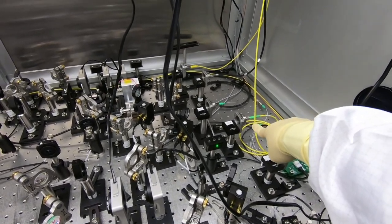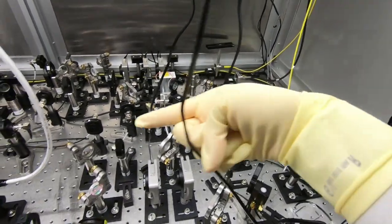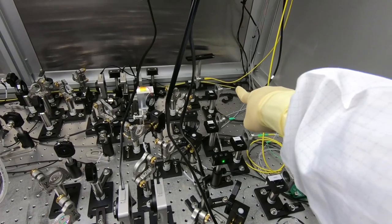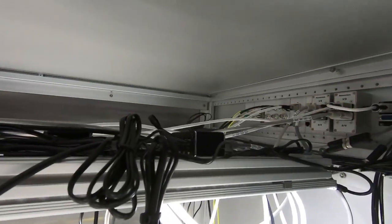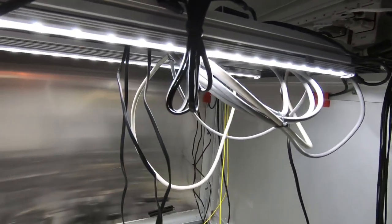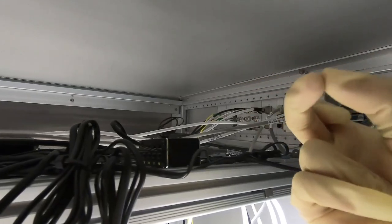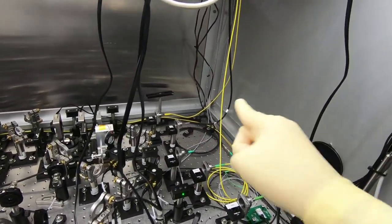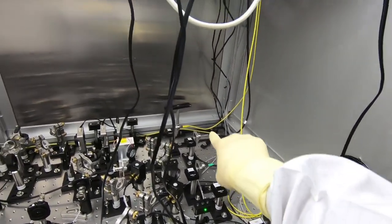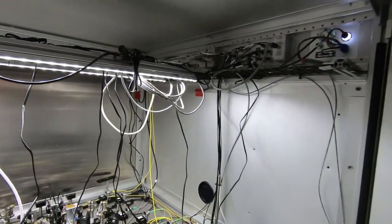This is the PSL LO, and that goes up here, and the beam comes out and goes around to that other fiber coupler LO. It goes out to that patch panel up there and over HEM6 to the other side of the table. So we're going to take the outside feed through fibers, two of them, and just connect them like that, so there will be no more light coming onto this table. We save the loss due to coupling efficiency here and there, and the loss through the two feed throughs. I hope we gain at least 30% of the power just by doing that.